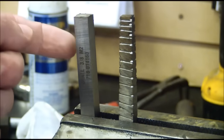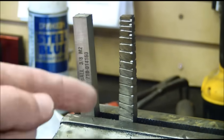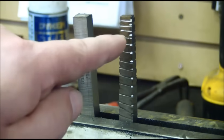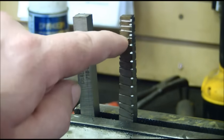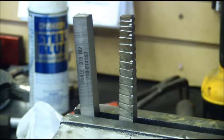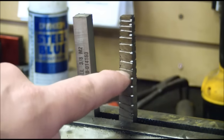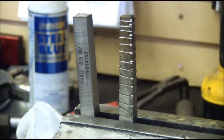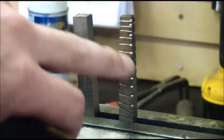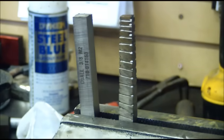Here's the high-speed steel tool bit that we want to hold in our fixture — this is square. Here's another tool bit that I've ground just with my angle grinder in the vise, and then with a die grinder and an abrasive wheel I cut these little slots. What we've made is a cheap little broach. This is called a broach and it's for pressing into holes to make the hole square. Once you've gone ahead and ground all four sides so it's a taper and cut these relief slots in here, you're pretty much good to go.